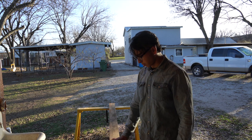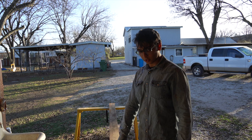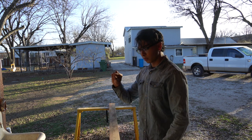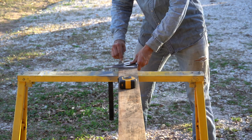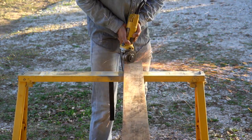The first step in building this dip station is cutting a triangle out of a piece of sheet metal — I guess you'd call it a sheet metal strip. This one is four inches wide and a quarter inch thick, and I'm going to cut a four-inch triangle. I'm going to measure four inches in, cut across that line, and cut two triangles. So that's what I'm doing right now.